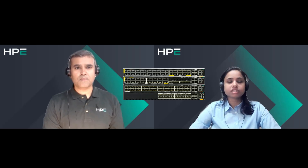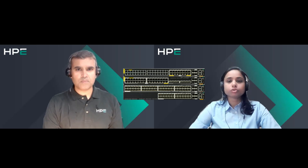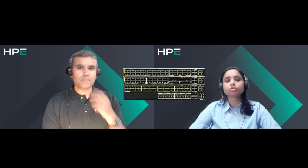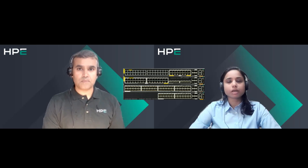The second set addresses the growing demand for SFP aggregation, offering 24-port and 48-port 1 gig SFP models. These are ideal for aggregating access switches such as the 6200, 6000, 6100, and 4100i, which can all be aggregated to our CX 6300 series. The SFP ports in these switches can also be used for connecting edge access servers, which is a growing need in campus environments nowadays.